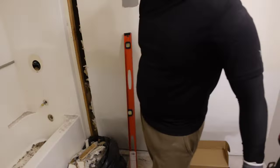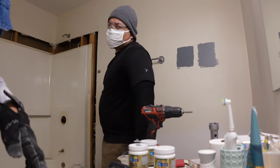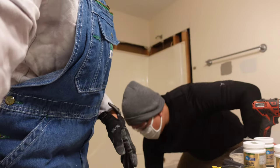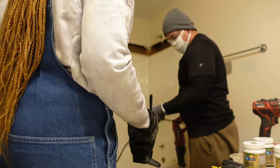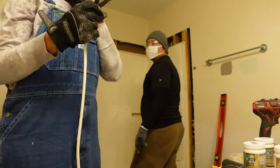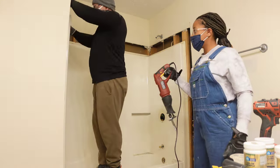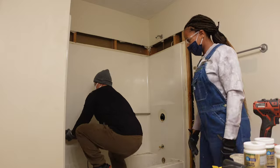Here's what it looked like — all the drywall has been removed. I did six inches away from the tub surround. I ended up going back in and cutting some more off because the new tub surround was just a little bit taller than the old one — no big deal, just go back in with the straight edge ruler, trace your line, make sure it's even, cut with your oscillating saw, and remove. Christian is again taking over with the reciprocating saw, but he's a little scared about potential electrical behind the wall.